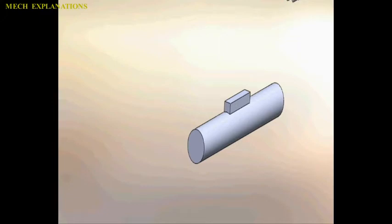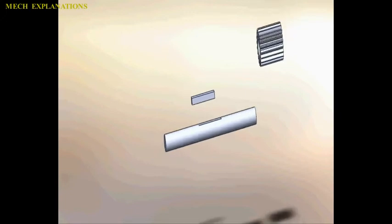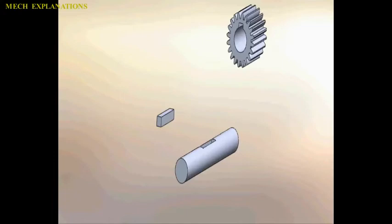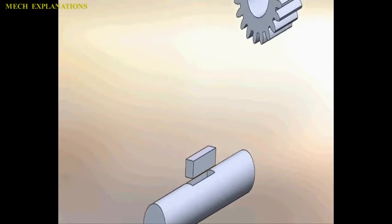They are very similar to vertical shapers. The difference is that the cutting tool on a keyseater enters the workpiece from the bottom and cuts on the down stroke, while the tool on a shaper enters the workpiece from the top and cuts downward. Another difference is a keyseater has a guiding system above the workpiece to minimize deflection, which results in a closer tolerance cut.